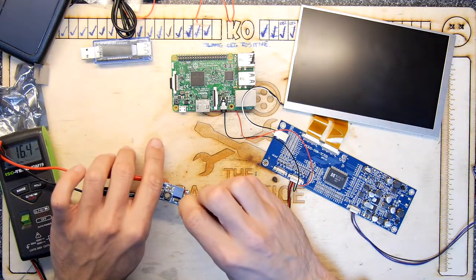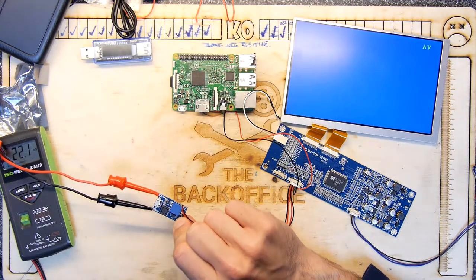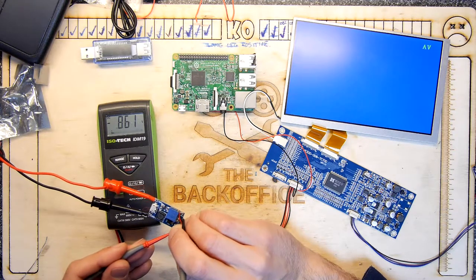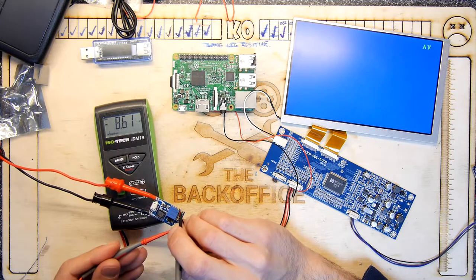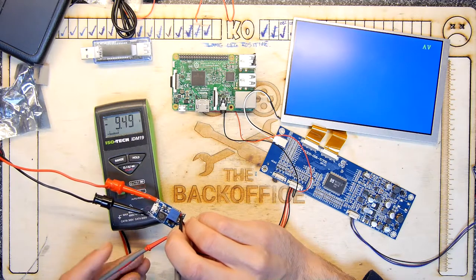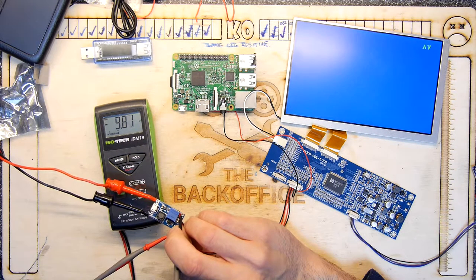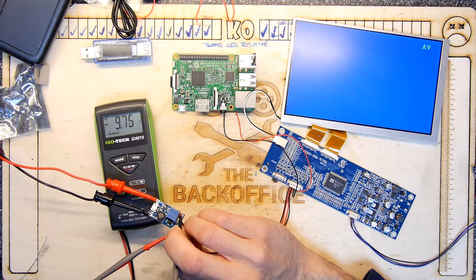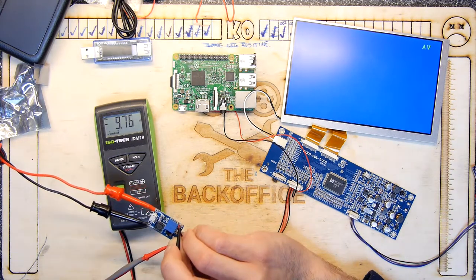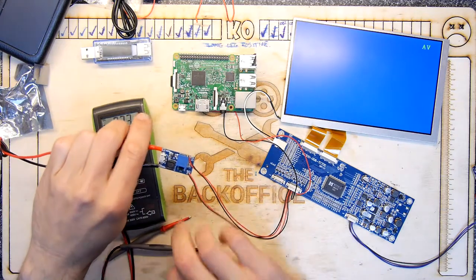So I don't know — I don't think it's going to work out for us. The panel's definitely coming on though, nice and bright. And with some dexterous use of my multimeter, I'm going to try to read the voltage coming out of this. It looks like we're driving it at 9 volts — we're getting 9 volts from our 5 volts. I'm just going to turn the bench power supply up. Now the bench power supply itself is outputting 9.3 volts, 431 milliamps. Putting that down to 5 volts it's using 750 milliamps, so it's eating a lot there — 750 milliamps through this whole setup.